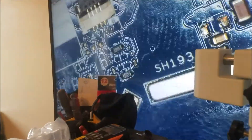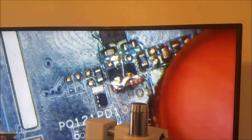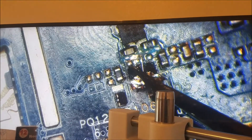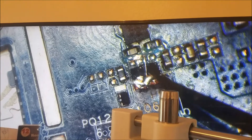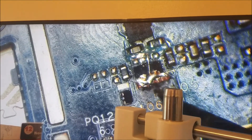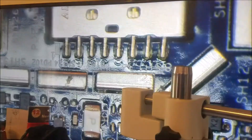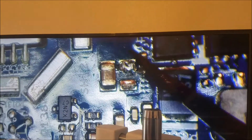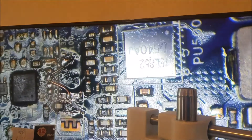On the other side of the board — I'm working without a schematic — there was also a MOSFET here and this is the gate. So we just connect and do the jumper between the source and the gate. It's better to use a tiny wire in case there's any short or overload — this wire will burn instead. I think what happened is the shorted capacitor was causing all this mess and all these problems.